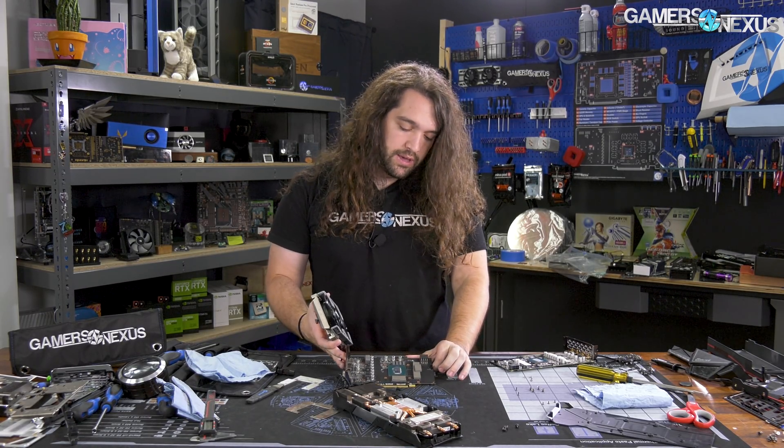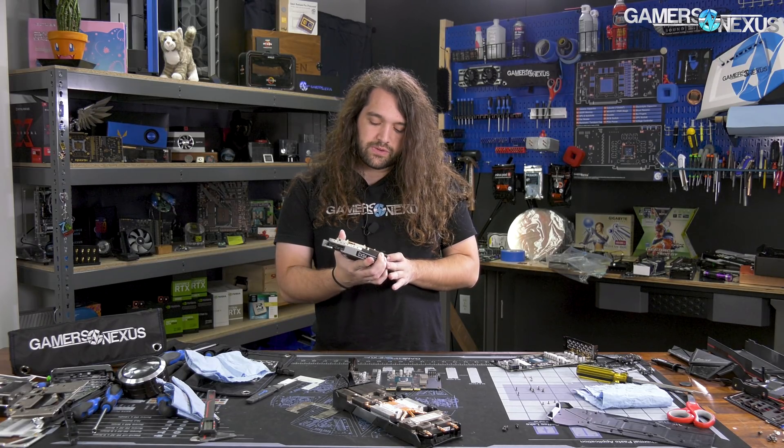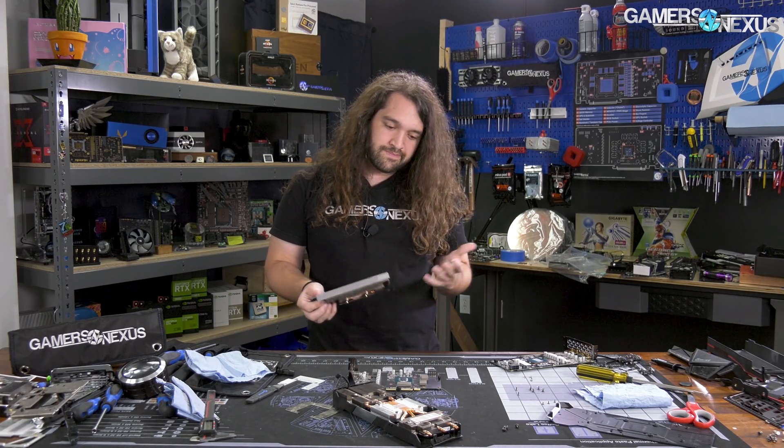So that's the teardown. These two are very easy in general — they're not expensive cards, and typically inexpensive ones are slimmed down on mounting hardware, so they're easy to take apart and maintain. For EVGA's card, I'll need to mount some probes to the memory. NVIDIA does not expose its memory temperatures even though there are sensors on the GDDR6 that are pretty accurate. We'd have to take it apart to do this anyway. We'll see the viewership on the 1660 Super review and make a decision — it's always a juggling act with other content coming out. EVGA could have designed that memory cooling better; now it's just a question of how bad it is.